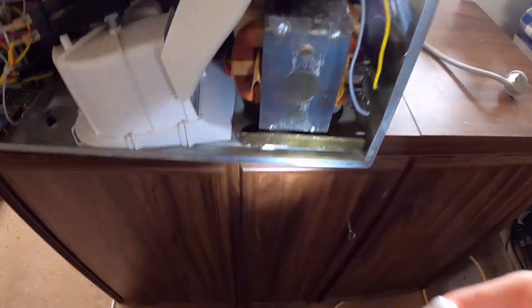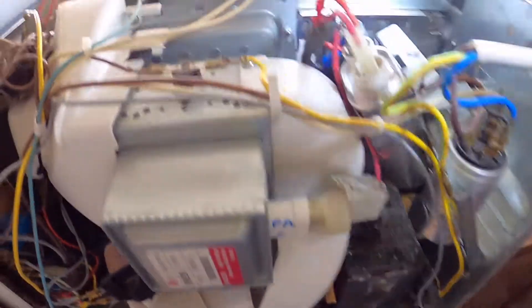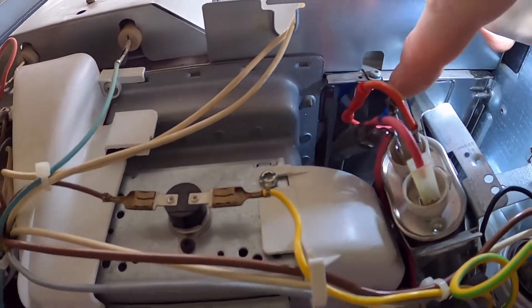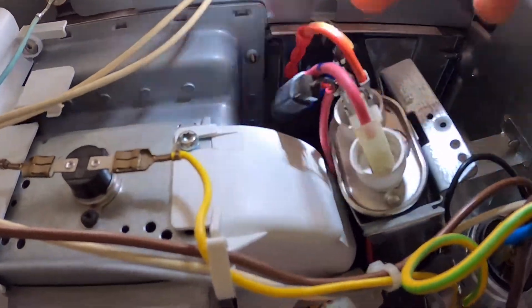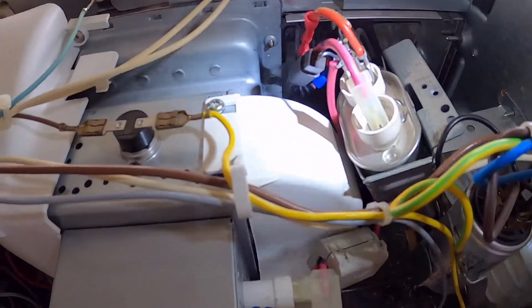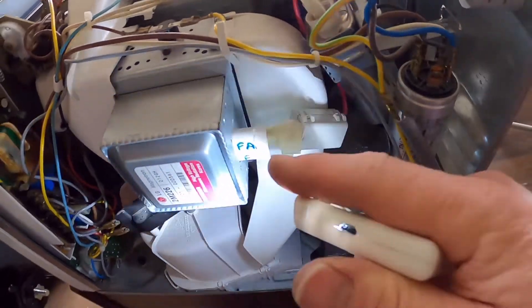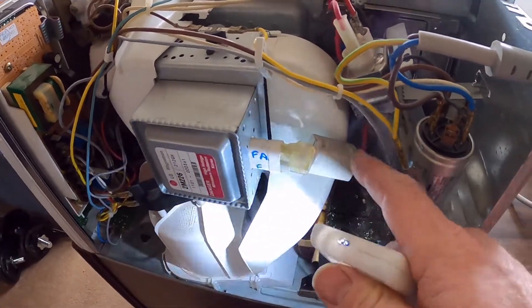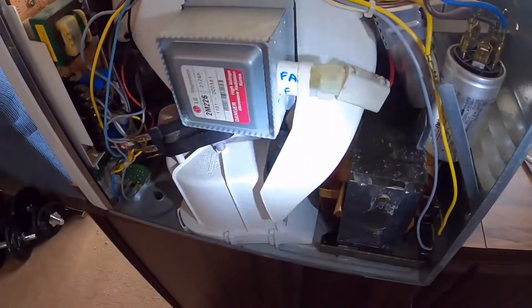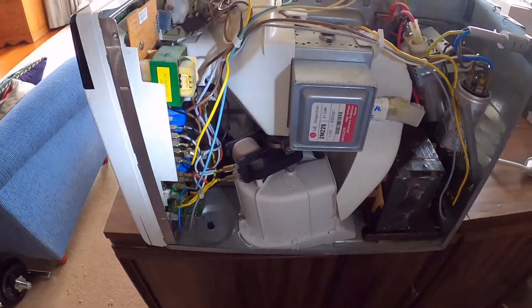Transformer's gone in. I got very lucky with positioning because it did slip a bit and nearly stopped the foot from working. The primary and secondary are connected up just like the Panasonic. I've connected the diode and a second diode to the cap — not sure why they put that one on. Got the main secondary to the cap for the pumping, and even put on the ferrite they had. The FA and F connected to the magnetron as per the Whirlpool. Ready to give it a spin.